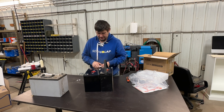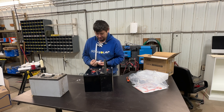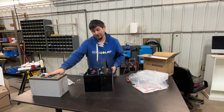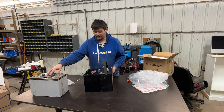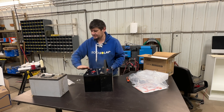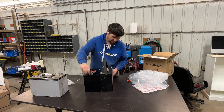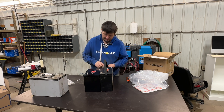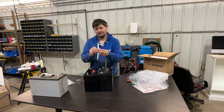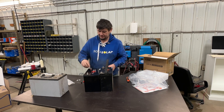I'm all about using different size batteries where they make sense, and that's what I love — all these companies are making different size batteries for all kinds of different applications. For the most part the reason why I don't have a lithium version of this is I really don't recommend it, because now you're getting 100 amp hours in this size — why would you buy 100 amp hours for that size? I do like that these posts are big enough to fit a couple of lugs, so if you're going to put a couple of these in parallel it's a little easier. They offer a couple of different sizes — actually these are all the same size, probably in case you lose one.